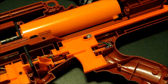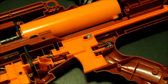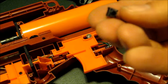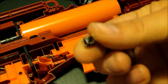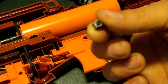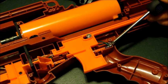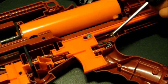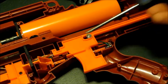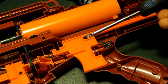The trigger here is one of the more unique parts of the blaster where the laser tag side and the Nerf side actually kind of meet. I've got these two wires running out from behind where the normal trigger placement is. This is actually a small push button — you can see it there. This piece was actually taken from the laser tag blaster that I was re-casing. You can utilize the buttons and switches that are already inside the blaster and still make use of them. That switch is just hot glued behind this assembly, so when this orange plastic piece pulls back, it comes into contact with that button, activating both the plunger system and the laser tag blaster.